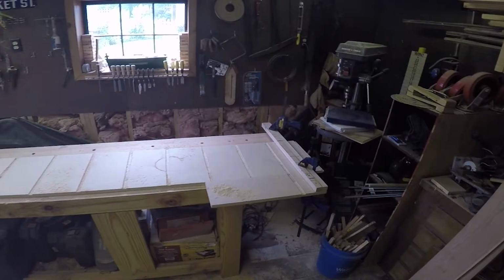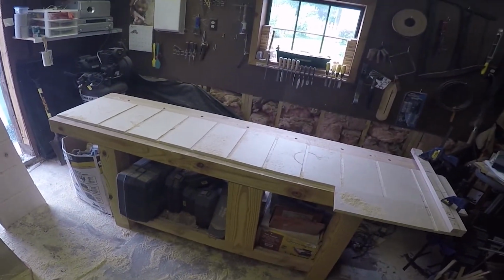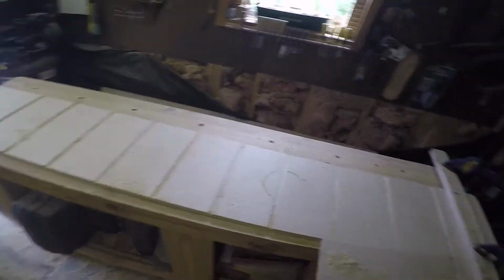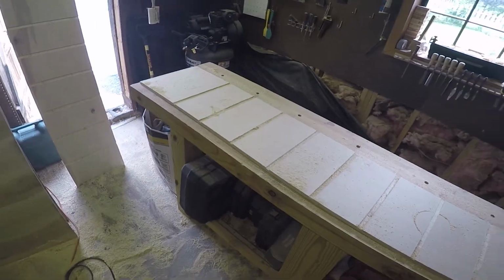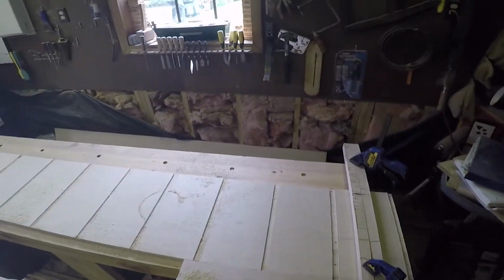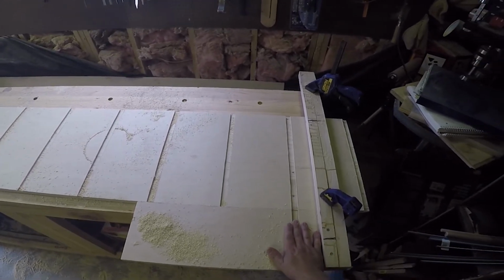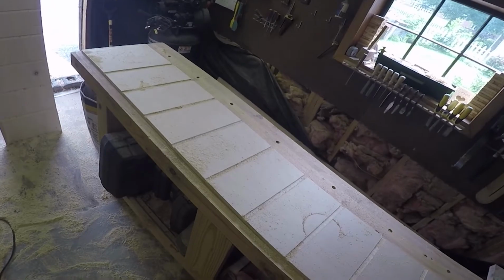And you know, as they say, it's actually better when you're doing woodworking to measure less. If you can measure off of a fence, measure off of a stop block, so your cuts are repeatable, that's always better. And that's exactly what we're doing here. We're using a fence with this pre-made groove to measure and go off of every time. So each time we do it, it's going to be a repeatable result. And I think the results are awesome.